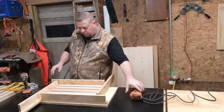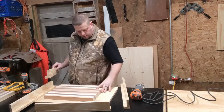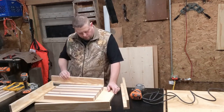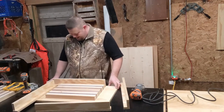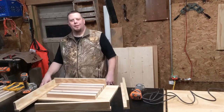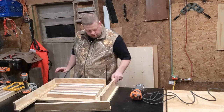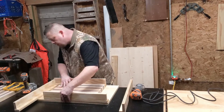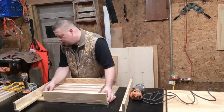We've got our four fences, we've got our cutting board — this is the smaller of the two I'm going to do right now — and then we've got a 16 by 28 inch sheet of plywood underneath. Most of the people I saw do this tended to screw them right down to their workbenches, and I don't want to do that. My top is sacrificial but I still want to keep it in as good a shape as I can. So we take one, line it up perfectly with the edge, go to the outside edge and make it flush right there.